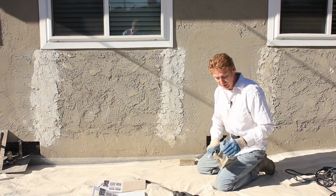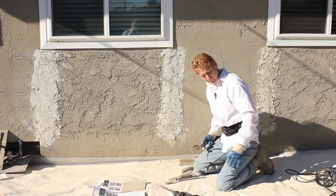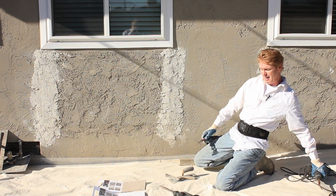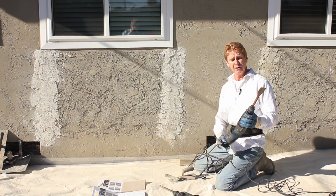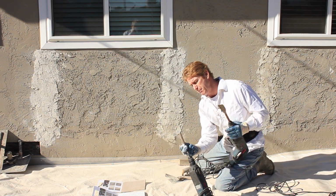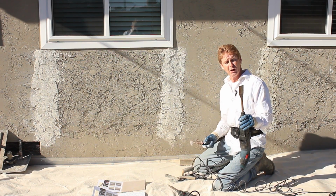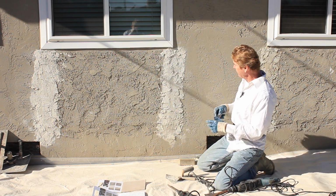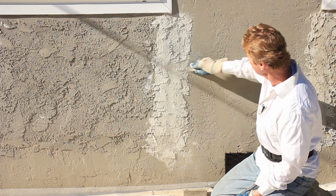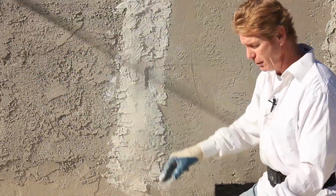You can go a lot of ways, guys. Trowels, putty knives, margin trowels. I'm going to use my bulldog here, and I have a special bit right here. So here's my regular tools for breaking out stucco, and here's for actually shaving it. So this is what we want to do, guys. We want to scrape this off. And you see where on a painted surface, it'll come off.